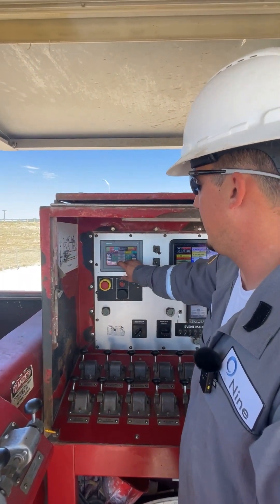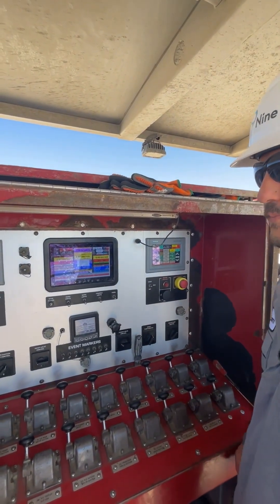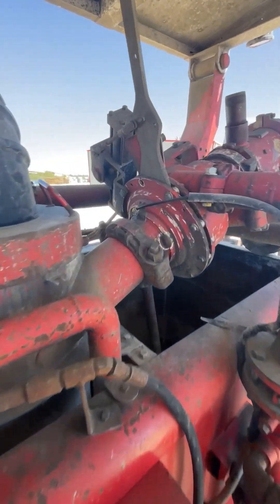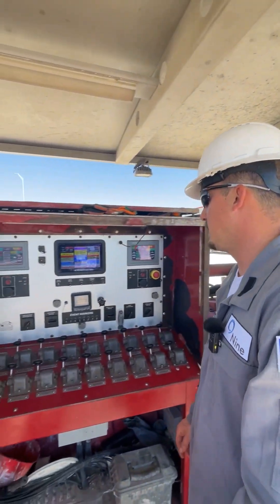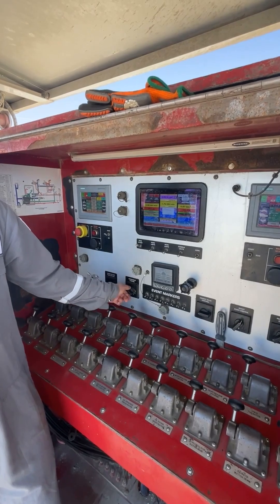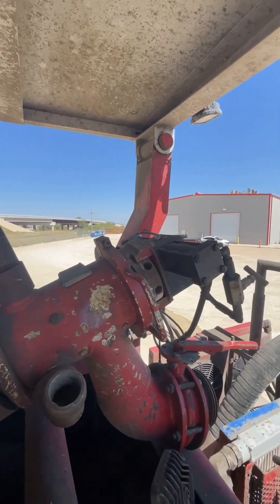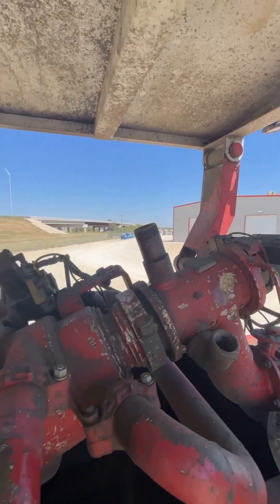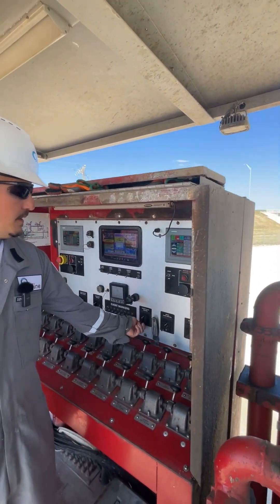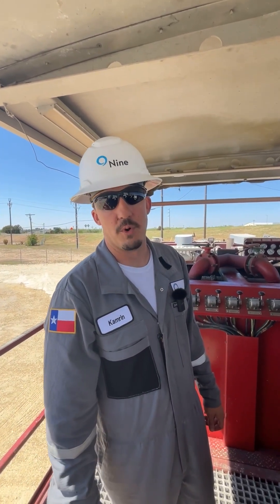Go ahead and drop our pumps into gear — first gear at an idle. We'll turn on our paddles. Now that we've got all the fluids warming up on the pump truck, you always want to leave your water knife and your cement knife in the open position, but you also want to function them and make sure that everything's flowing free while you have the time. Now that we've verified that everything's warming up and everything's clear, we'll wait to bring water on the truck.